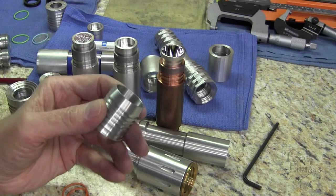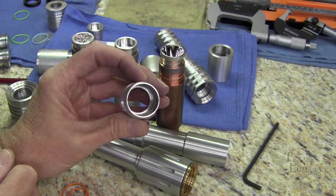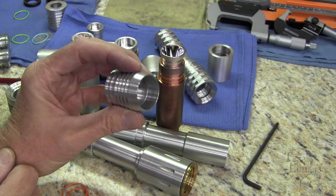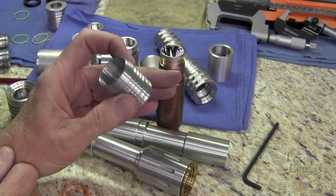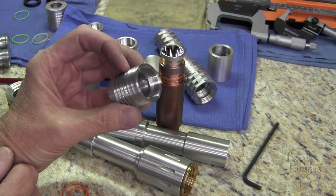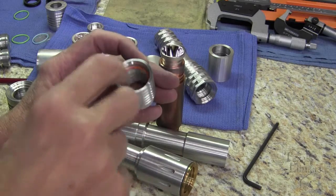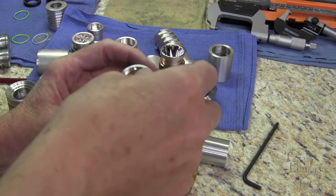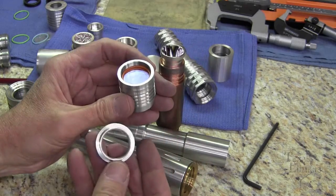After sculpting the OD, we can no longer hold the stock directly in the chuck. As with most every flashlight part we make, there are multiple sets of threads, OD and ID dimensions — all of it varies. Although it looks finished, it still needs tumbling and anodizing. This one gets double O-rings for the lens, as these are going to be used out in the oil field industry.